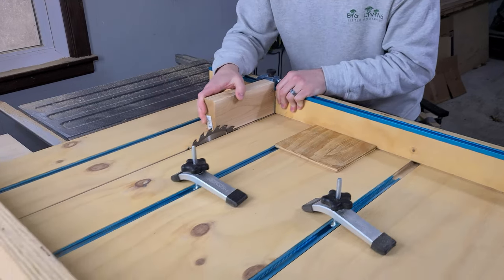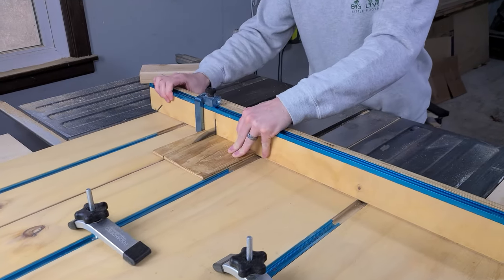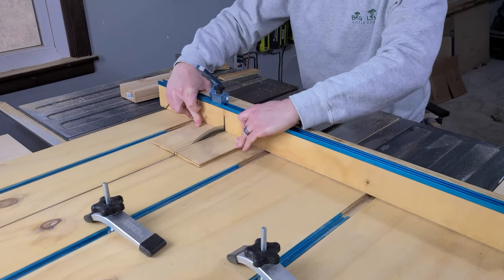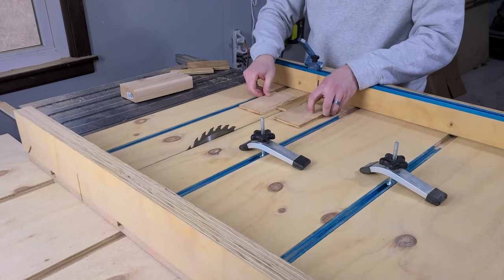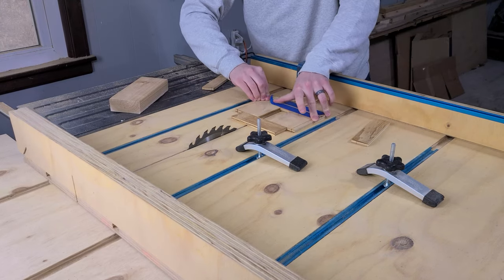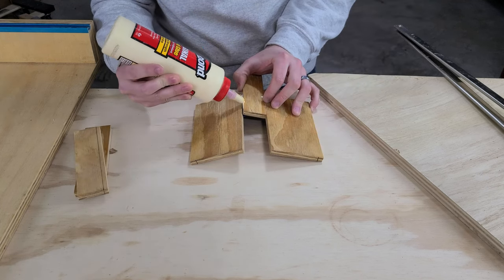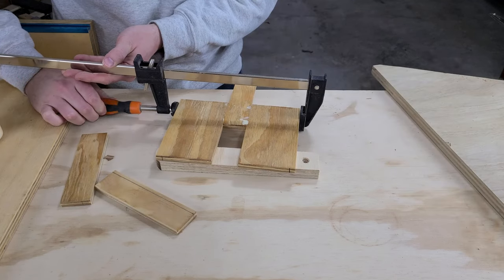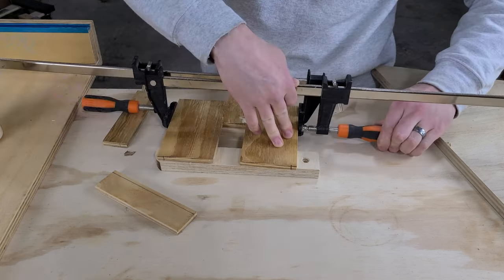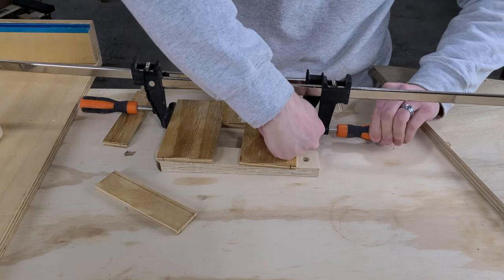To install the half-lapped boards to our posts, we're creating castle joints. We wanted to try doing this with the router this time, so we're going to start by making a template. We've 3D printed templates in the past, but today we're going to show you how to make one from scrap wood. Head over to the table saw and cut a scrap of plywood to be the same width as an off-cut board, then position this scrap between two more pieces of plywood and check its fit. Once we've dialed in the fit, we glue the pieces together. I re-glued it with super glue and that was much faster and stronger — for something like this, save yourself the time and just use super glue.